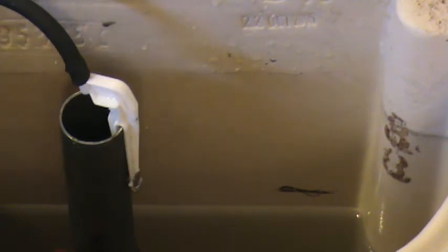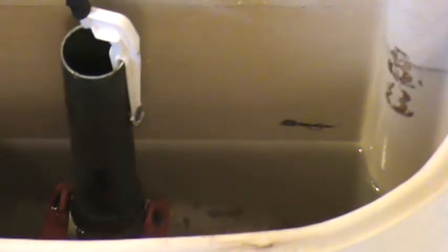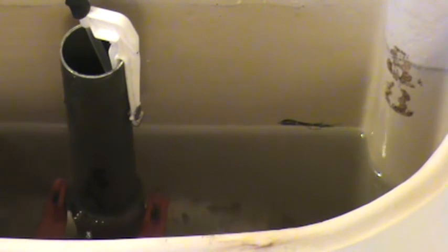Now, we can turn the water back on. And, you know, in reality, it'd be nice to get that water up just a hair, because we know the other one had it adjusted in such a fashion to where it was lined up at least with the pencil mark, right? So right now, this toilet is actually flushing 1/2 inch more than the initial one. And if anything, we want to save some water. We want to keep making sure that it still flushes properly too, though.